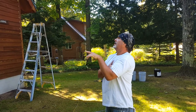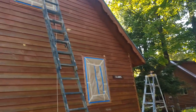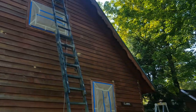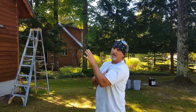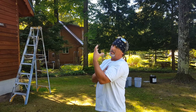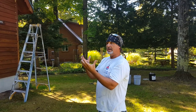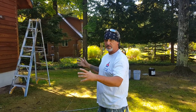What we're doing now — you can see that great stuff up there — that is oil-based primer. Some of you are probably wondering why I'm using oil; it's messy. There's a reason: I'd rather use latex, but latex is not going to have the proper blocking properties you need on cedar, because you get a lot of tannin oils that bleed through and make your paint job look ugly. So you seal it up with oil first — Sherwin-Williams will tell you all about that.